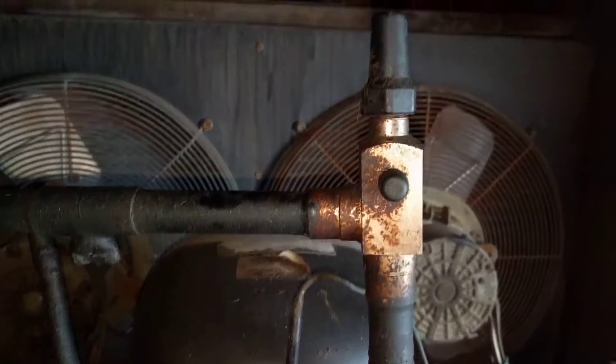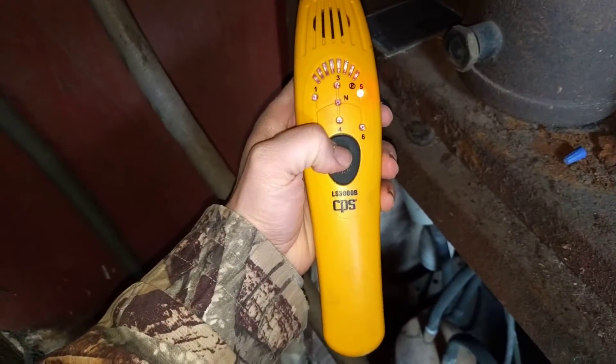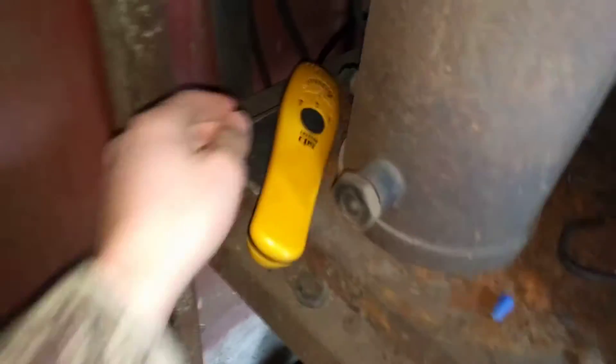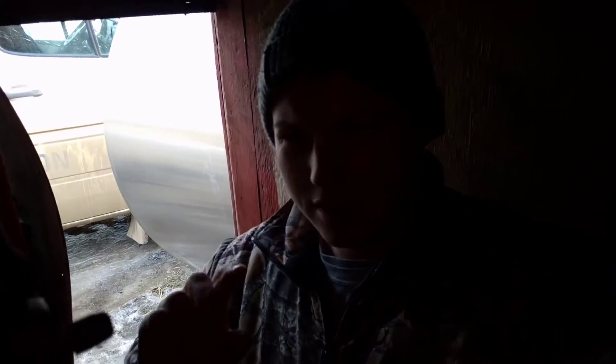As you can see, it does work pretty well. But you just have to be aware that it can be a little bit touchy, so you have to turn it off and turn it back on again multiple times and go over the same area to make sure that you have a leak. In this case, I've got a leak on this cap and I possibly have a leak on this line here too. Usually once I get it close to the area where I'm pretty sure there's a leak, I'll use a little bit of soap or bubble leak detector to verify exactly where that leak is.